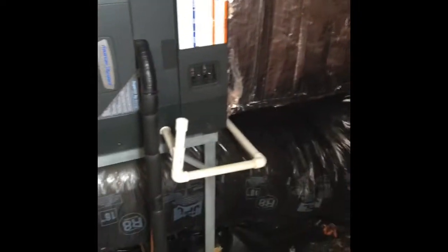Over here is our supply side. There's a splitter in here that splits off to two 14-inch ducts. I know what you're thinking — 14-inch ducts are pretty big — but with any zone system you really need to oversize your ductwork and let your dampers work. We did a lot of math on this one to figure out what we needed to make it perform the way we wanted, and it has been performing beautifully.